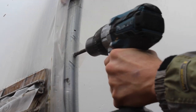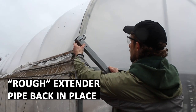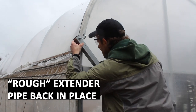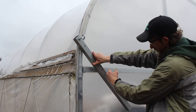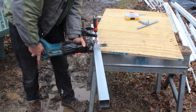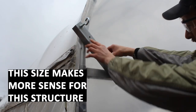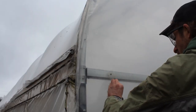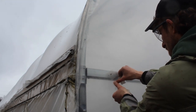I push straight through to the other side all the way. After cleaning the hole out, we have our two holes — they go all the way through cleanly. I rough my extender pipe back in and line up the holes in my extender pipe with the holes in my end wall framing. I notice my extender pipe is pretty long and decide to cut it, which will help prevent potential wind damage where it protrudes down into the face of the end wall poly. So I make a mark, clamp it to a table, cut it with the reciprocating saw, and use a metal file to clean it up. I also add an additional piece of poly repair tape to protect the plastic where the bottom of the extender pipe will contact it.